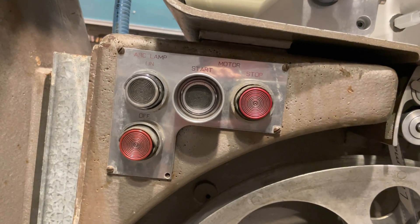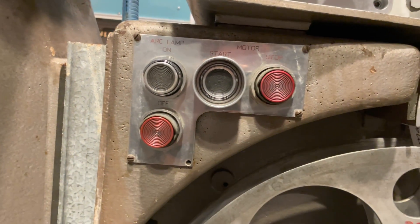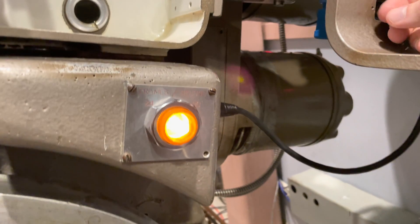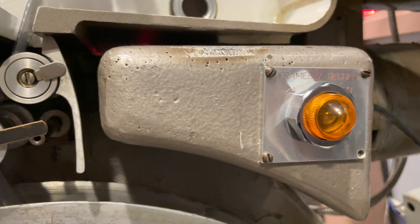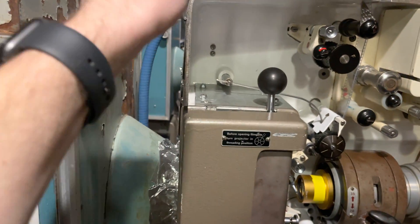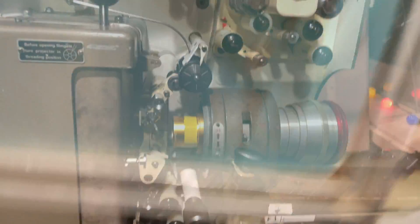Now I'm going to show you how to use the DP70. We have four basic buttons. For all DP70s, we have the motor stop, the motor start — which I'm not going to push yet — the arc lamp on and off. We also have a changeover switch. It's different on every projector. In our case, we actually have a custom-made solid-state one — when we switch this, now this one is changed over and we're active on this projector. Switch it again: off. Same thing on the other projector. There's also a frame rate selector — it says 24 and 30 frames per second. This supports two frame rates, but we never use 30, so we swap this out. Also, to use this on all projectors, you have a lamp house — this is how we open and close it. We also have sound controls down here. In this case we're using Dolby Digital because this is a Dolby Digital film, so we click that and now Dolby Digital is active.